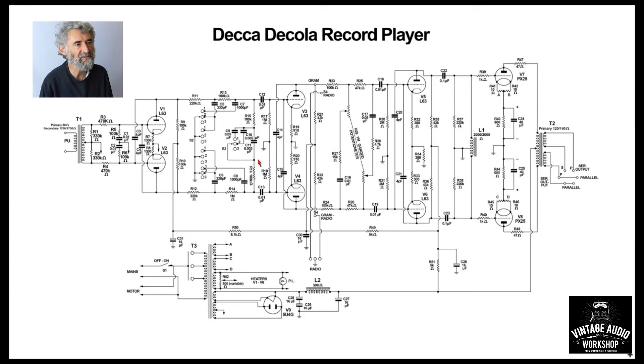What I said about the frequency response here is the same as before: it has no effect at low frequency, but at the high end that capacitor looks like a short circuit, giving a potential divider between all the input resistors and this one here. In this case it goes not to earth but to the opposite phase. You can then add nothing, another 0.005µF, or a 0.05µF — that last option must be fairly severe treble cut. The valves have separate bias resistors and again they're not bypassed.